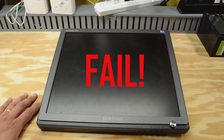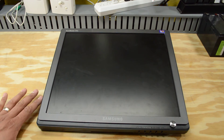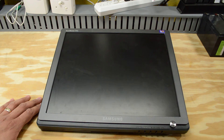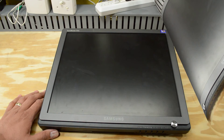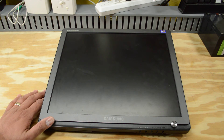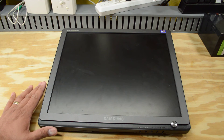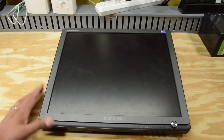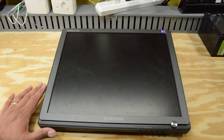After all that work, it's still broken. I had everything put back together and double-checked that all the cables were plugged in properly inside. I hooked up my PC, turned everything on, and I did get an image — actually a really nice image — for about a second, and then it went away. The first issue I was troubleshooting has been taken care of, but now I've got a different problem altogether and I'm not going to spend any more time on it. Sometimes you win and sometimes you lose, and in this case I'm calling it quits on this particular monitor. I only spent maybe 3 or 4 dollars in parts for the capacitors and a little less than an hour of my time. I'll go ahead and look for another monitor of the same size, which I think will work well for my project — so I'll take that away as a positive.